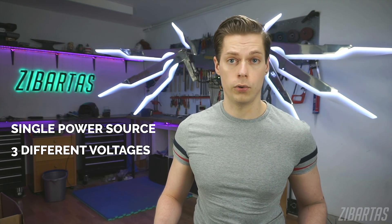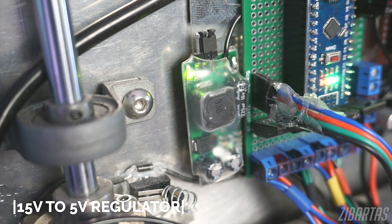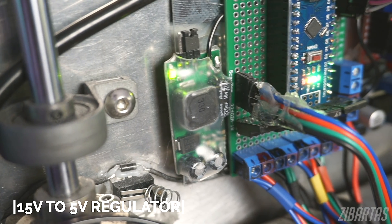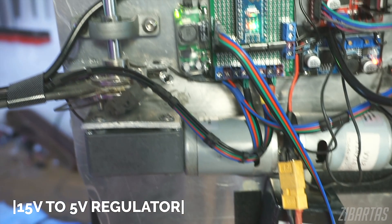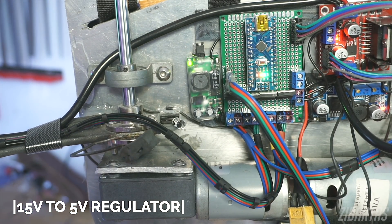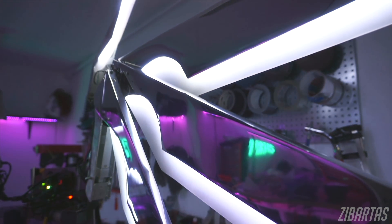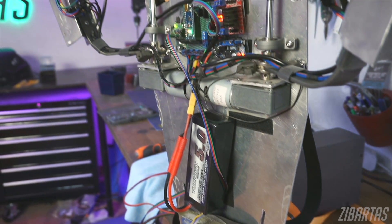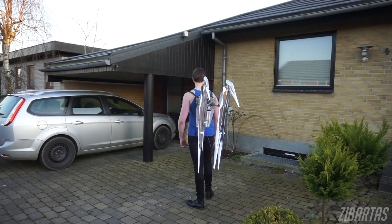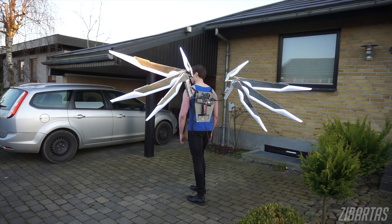Powering this beast was a challenge. In the entire system there are three power rails: 5, 12, and 15 volts. This is a 5-volt voltage regulator — a device that limits voltage. It takes 15 volts straight from the battery but caps the output to 5 volts to power the Arduino. The LEDs should receive at most 12 volts, so there's a second 12-volt regulator for that. The motors are powered directly from the 15-volt battery. Even though they're rated for only 12 volts, since they don't spin for long periods at a time, they can handle it — I'm overvolting them so they run a bit faster.